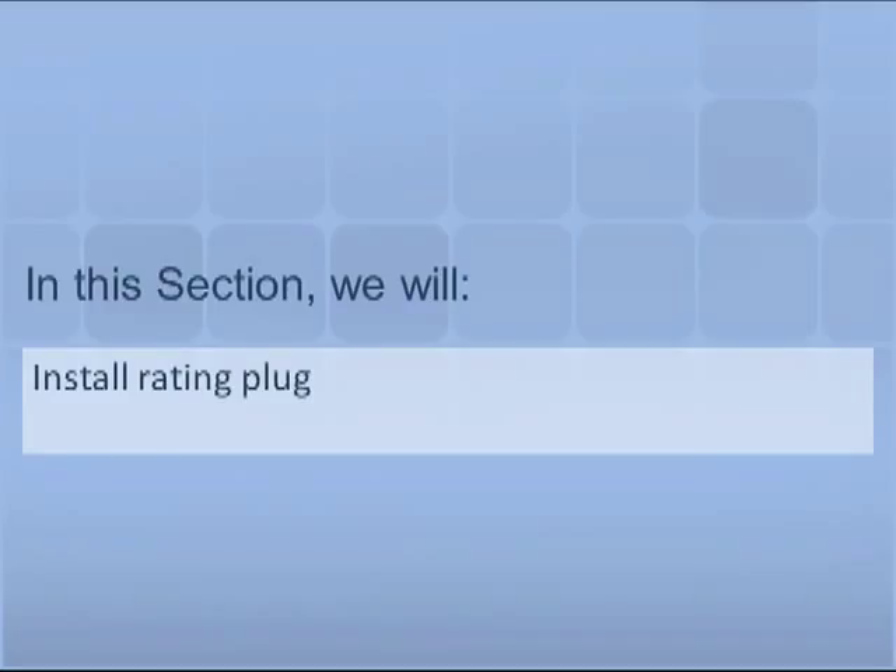In this section we will demonstrate how to install a rating plug into the Series NRX breaker. The incorrect rating plug will not engage the circuit breaker frame properly and tighten down. Install only rating plugs from the rating plug group matching your circuit breaker rating. Refer to IL70C1592 for rating plug tables.